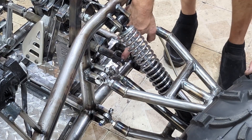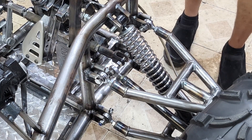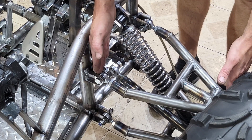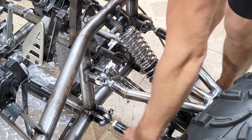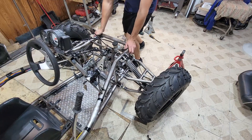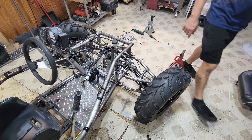What I did here is just mocked it up with just a piece of threaded rod and some nuts to space my tie rods back far enough that they're not going to hit the shock. And I made sure my spacing was correct from the tie rod compared to where the heim joints sit on the A-arms, and I even tried to get it as close as I could with the tie rods being level with the A-arms. Once I did that, bump steer — I would call that almost 100% eliminated, and it's kind of hard to see so I'll try to show you the best I can.